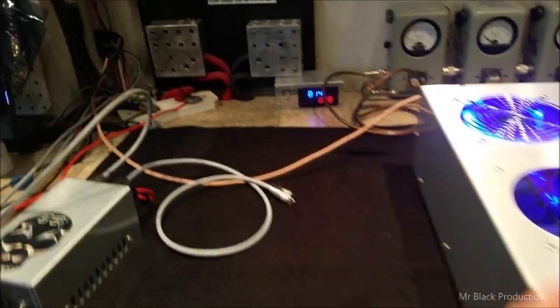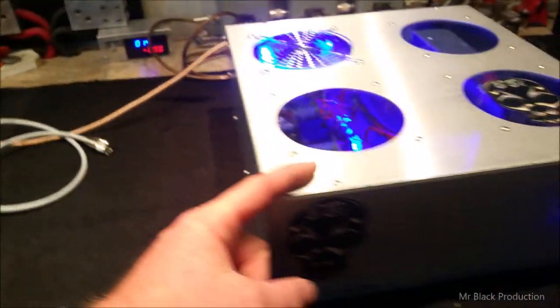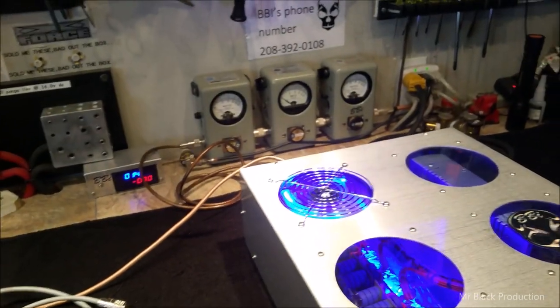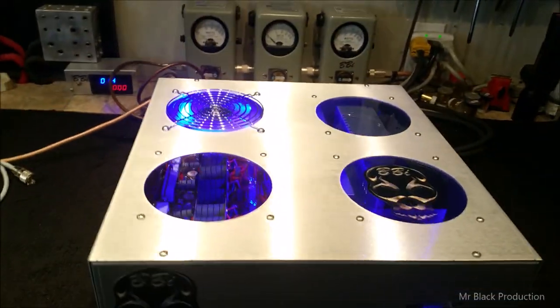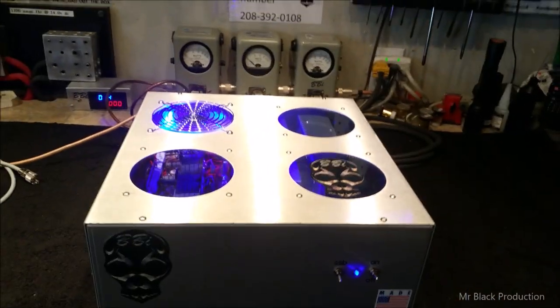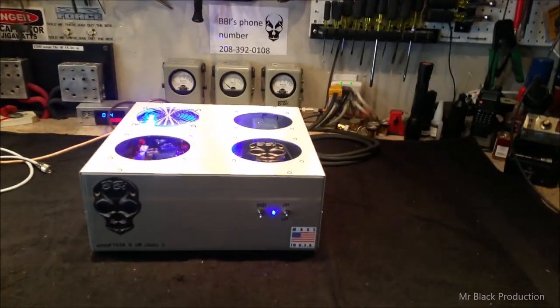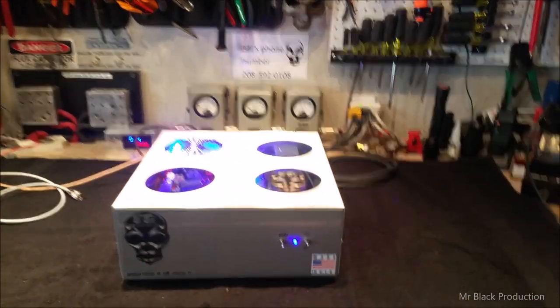The point is, amigo, you take a 30 watt radio and you run it into something like this, you're going to see 16 to 1700 out of this, your bird wattage is right, and the amplifier is golden, my friend. We're done. Wrapping this puppy up, we're in top shape. Throwing in the soldering iron, and I'm walking away.